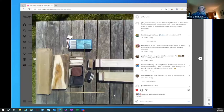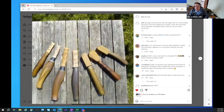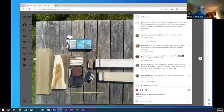If you could, Chuck. So, to encapsulate the process I use in a nutshell: a rough piece of wood that's squared up. If I'm going to do some laminating, I chop up some laminates. Again, I use a chop saw for that, so it gives me an absolute square edge, and then face them up. I glue them together, which you'll see second to the last row, and then glue that to the handle. So the handle I pre-drill. Sorry, Chuck, I jumped too soon. No, we're reading each other's minds here. So the handle I pre-drill, put the laminate on, and then line up, because the laminates are only a short section, so I know where I'm drilling from the start. Thanks, Chuck.